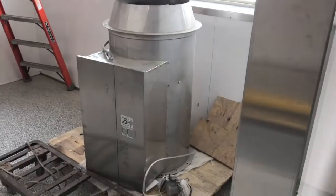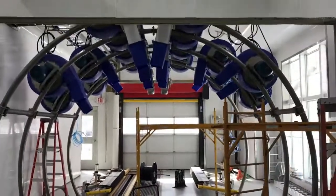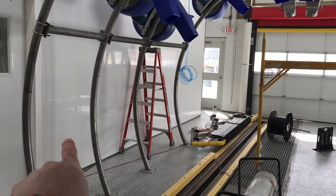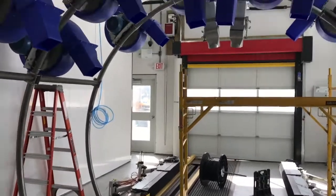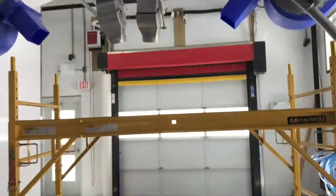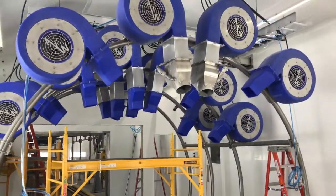You know, we've got the 1 million BTU heater. There's going to be 2 of them in this drying system. The spacing of these hoops is 3 feet. Between the first one and the second one is 3 and 3. And then the last one is about 4 feet, where the 2 heaters will be pointing straight down from the roof. The ceiling height here is a little more than the usual 12 feet. We need a little more to mount those heaters that far.